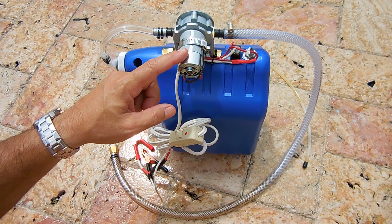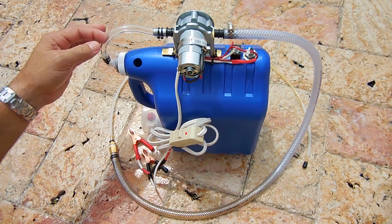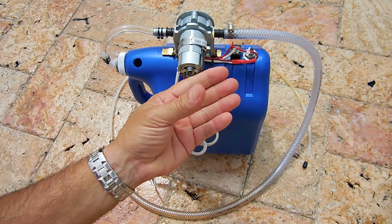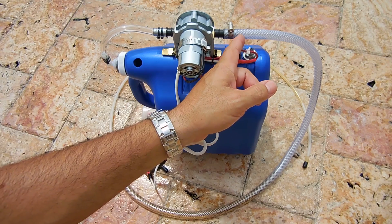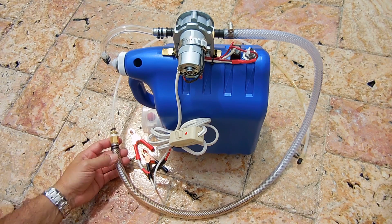The relay is a 10-amp rated relay bonded to the bottle using e6000. This relay handles the current from the motor because the float switch is not designed to handle that much current. When you purchase the pumping unit it also includes tubing. The included tubing was fine for the discharge side, but on the suction side it tried to collapse a little when the oil was warm, so I recommend picking up braided tubing from a hardware store — about three feet at around a dollar a foot.